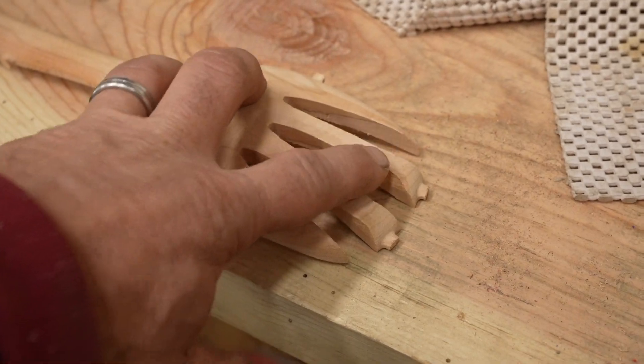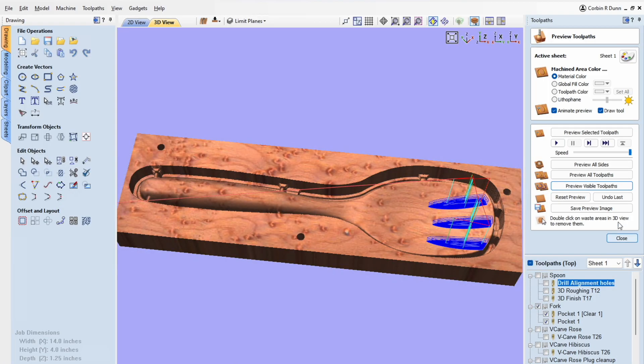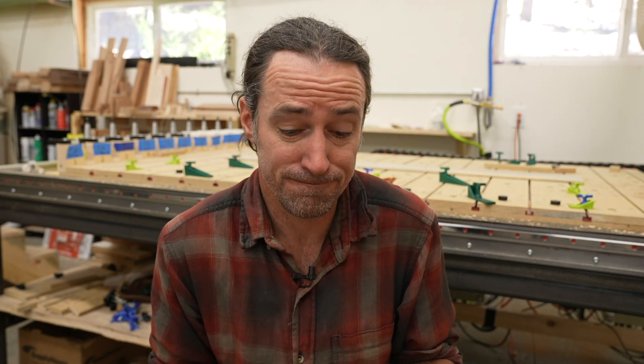Before I go into actually machining stuff, I'll talk about some of the experiments I did. I got a lot of chip out as shown here, and this is because Vectric VCarve isn't great at tool path generation for one particular model. The way I solved this is I realized the tool paths would be better if I could cut the teeth of the fork out afterwards. However, if you just import a model and the teeth are in it, it's hard to control what's cut at what particular time in VCarve. What I did is I decided to just draw vectors on my basic spoon shape and cut those out when I want a fork — these could be cut out at the appropriate time to avoid chip out. So it's tricks like this that I had to figure out to get a good result.